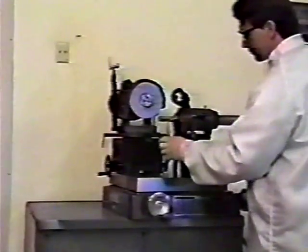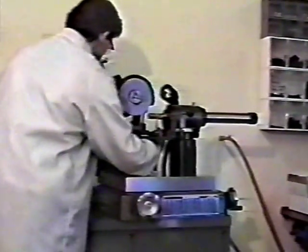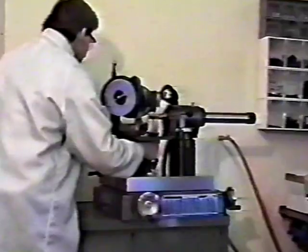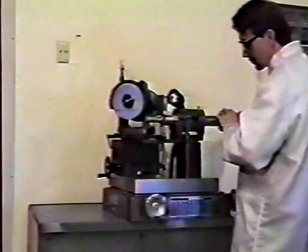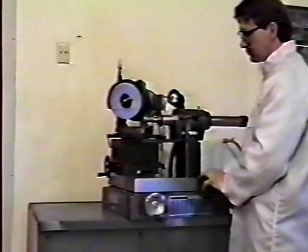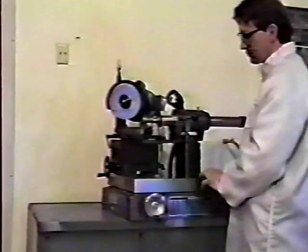Set the air bearing swivel base at zero. Swivel the motor to 31 degrees, then tighten the two cam tighteners. Most helical angles on rougher end mills are at 30 degrees — you add 1 degree so the wheel does not drag on the flute. Some roughers might have a tighter helix, so try 35, 40, or 45 degrees. Most roughers will be at a standard 30 degrees, then add 1 degree for eliminating wheel drag. Keep the tilt on the wheel head at zero.